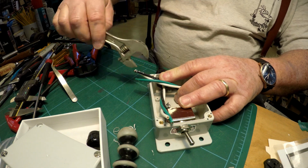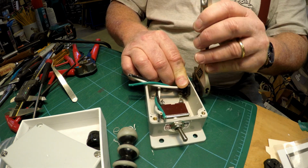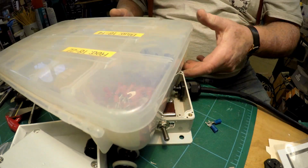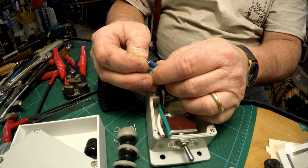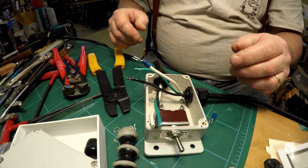Unfortunately, houses are rarely supplied with it, so having a machine tool that can synthesize its own three-phase is a good thing for hobbyists. Now, there are other ways to synthesize three-phase from single-phase using electromechanical methods, but they waste power, produce unequal phases, they're loud and hot, prone to failure, and they're expensive.